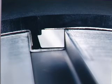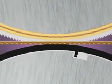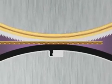Time-saver's solid steel lock bar fills the die cutter keyway with metal, providing a consistent cutting surface for the entire circumference of the cylinder. The operator can then use minimal die impression depth for clean cuts, one of the primary ways of maximizing product quality and blanket longevity.